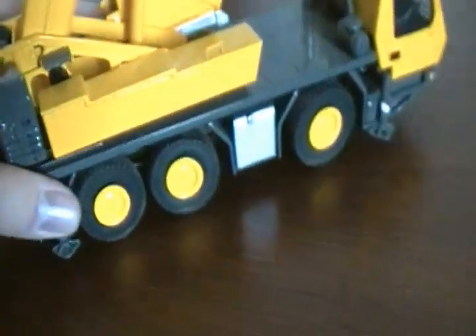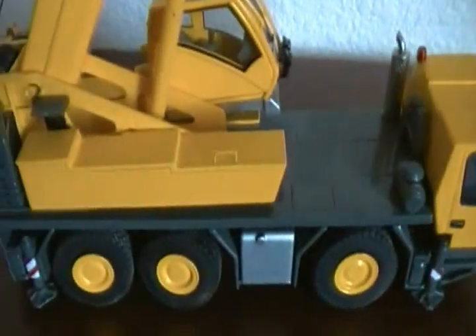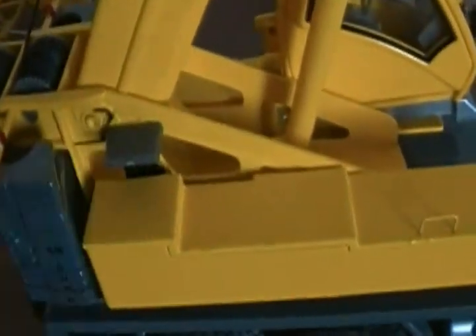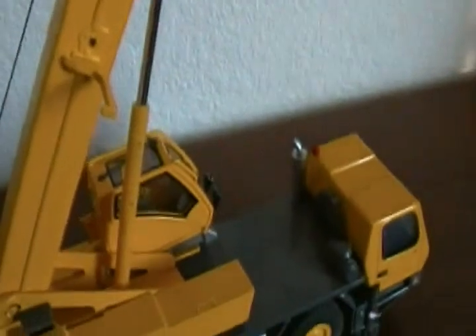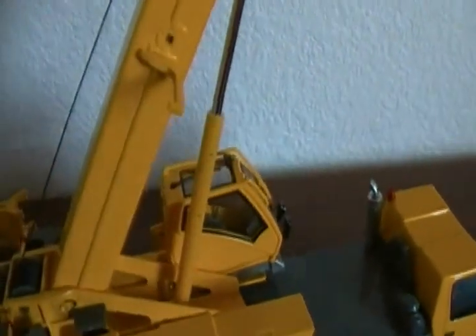Continuing on, we have the spare tire in the back. On this side — what I'm calling the one downside to this model — this side looks very plain. There's really nothing going on here; it just looks boring. But that's really the only downside. On the other side, you can see better: on your hydraulic you have two different boom lock positions where you could take one of these pins and stick it in there to keep the boom from closing. If you had a load hanging out there, it would keep it from pulling itself down. But that's not too big of a problem because this is a pretty good, very stiff cylinder — it works out really well.